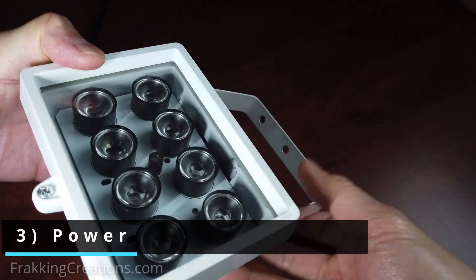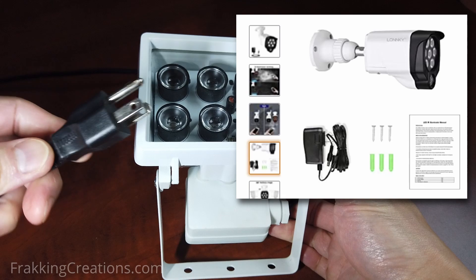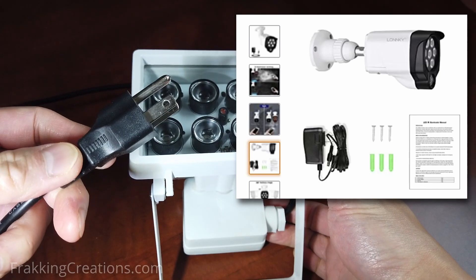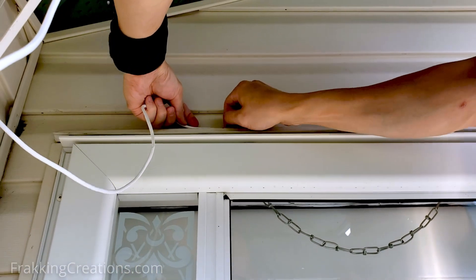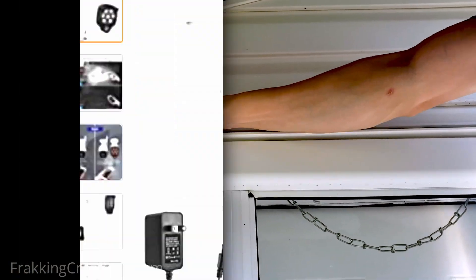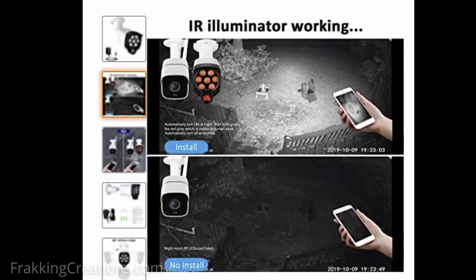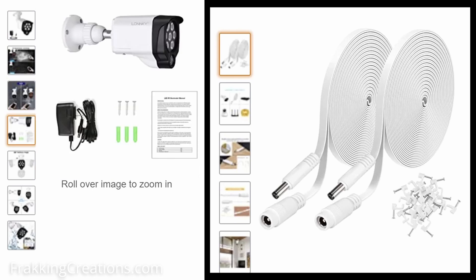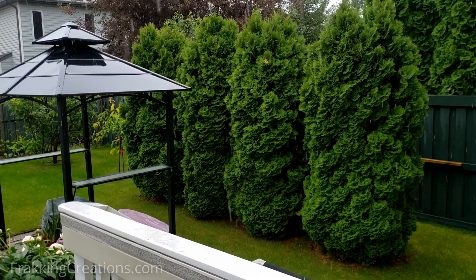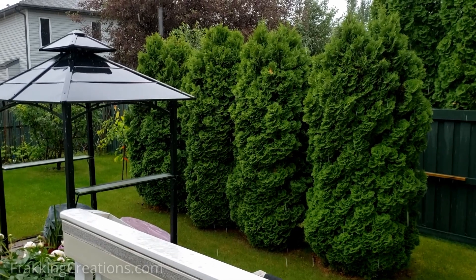Power: there are many infrared illuminators out there and most either use household AC power or use a 12-volt adapter. Note that a 12-volt adapter model may be better for ease of installation, as extension cables are thinner and easier to route than AC extension cables. Ones like this come with a 6-foot adapter, but you can easily buy a 20-foot extension cable. No matter what, you will still need AC power to power these, and a proper outdoor junction box or enclosure may need to be installed for safe use outdoors.